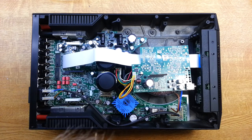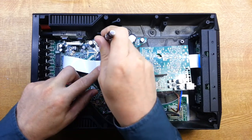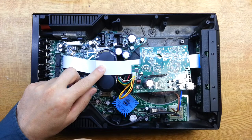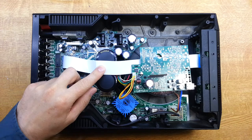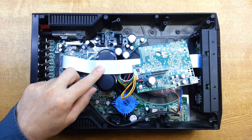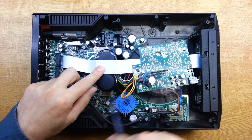The other circuitry is very similar — the power supply stuff is pretty much the same. We've got our plus and minus 15s here, and I notice the usual thing where the electrolytic capacitors are angled towards or jammed up against the heat sink. In my mind, this is an intentional built-in failure mechanism, because these capacitors are just going to get hot and that kills their lifespan. So whenever I see this, I move the capacitor away to give it the best chance. These are okay at this stage, but in time they would have failed before any other components in the unit.